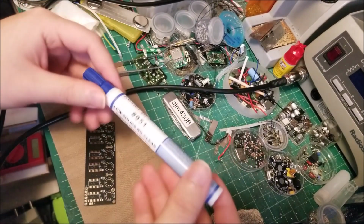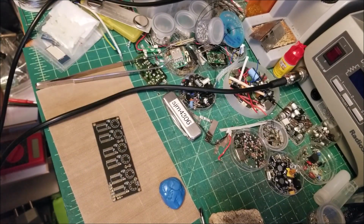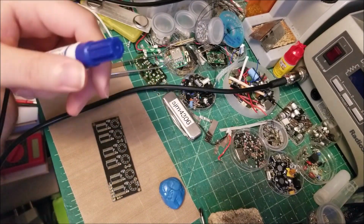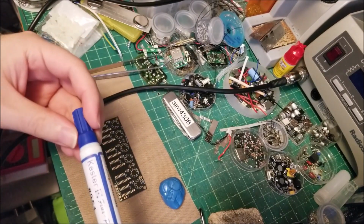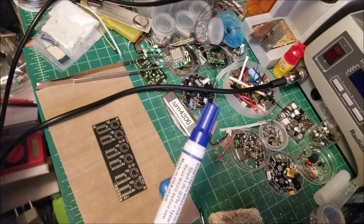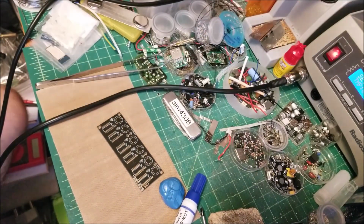And a first for my channel, I'm going to try out this Kester flux pen. I've always used syringe type flux, whether liquid or gel, so I've never tried these pens. They're cheap, and I thought I'd give it a try. It should be less messy. This is supposed to be no clean, or as I say, less clean, because it's liquid type. It should be quite a bit easier to clean off, not quite as sticky. So anyway, let's fire up the iron.